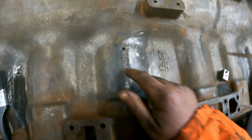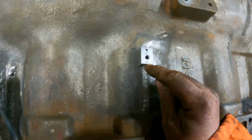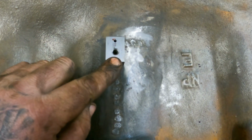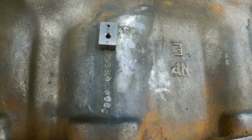So we've got our reference hole, and this is a jig, goes into there, and that gives us the other spacing to get between these. So we use that to pick up the spacing, and then we go back to that one to keep going down. We don't do, like when we did the first set of holes, obviously we did every hole. When we do this next run, we do every other hole. And the idea is that we don't want to drill both sides out of one of our new pins, and potentially the more material we move out, the more chance of it twisting or moving, and that's a bad day in the office. So we'll let the Loctite go off.